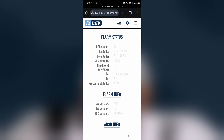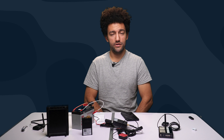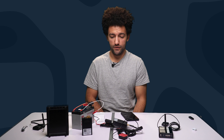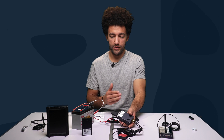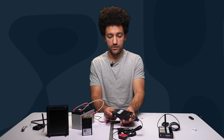In this video we've shown you how to update and configure your FLARMs. The main takeaways: update your FLARM once a year; make sure any SD card or USB stick is inserted or removed while the FLARM is turned off; and if you've got a later version with Wi-Fi, once it's set up you can simply connect via your phone once a year to make any changes. Thanks for watching — we've also got a video on how to update your LX9000 and an unboxing video on the PowerMouse and PowerMouse Plus.